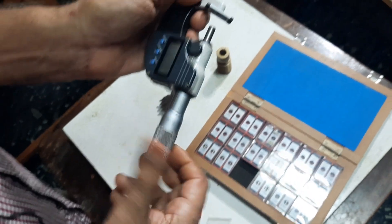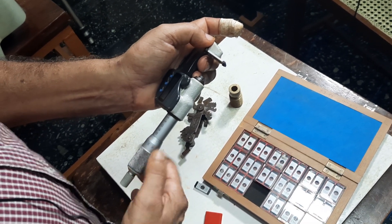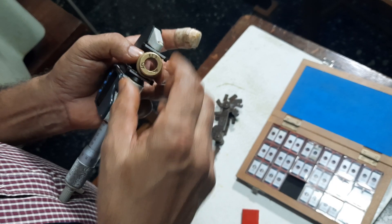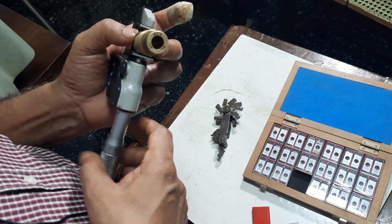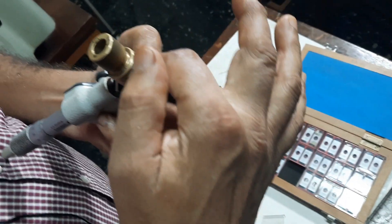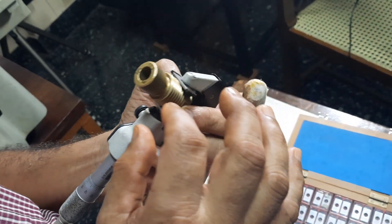This set has 2 wires here. Hold the workpiece in between. This side is having 1 wire and this side is having 2 wires, and the thread specimen must be vertical to the axis of the micrometer. Only then will we get the correct value.